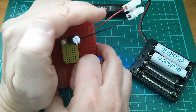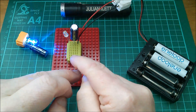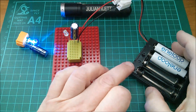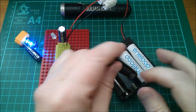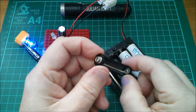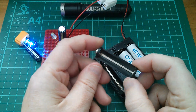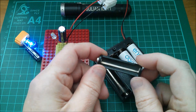Now this one is discharged, so let's put that in the charger — make sure everything's the right way around. That LED is completely off at the moment, so the voltage on the capacitor is going to be low, and it's shooting up quickly because we've got a fair current running through here — not enough for anything to melt. There's enough resistance in all these connections. Incidentally, I've also got these dummy AA cells in here — are they warm? No, they're not warm.